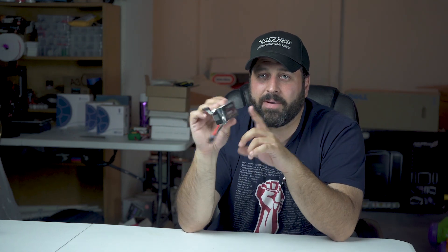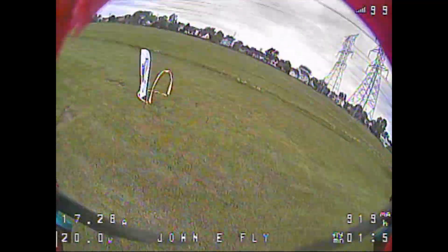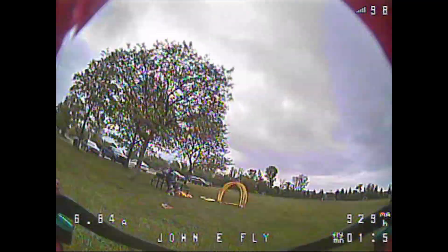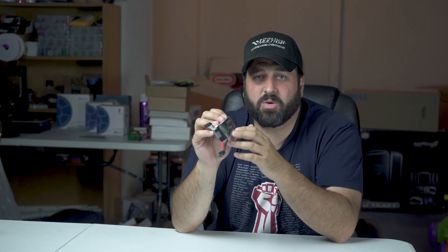The cost of these packs is $29 — the exact same as the Pyrodrone packs. They look real nice, they're pretty packs, and they perform well when you're pulling amps, but the capacity does not match the rated capacity. Today at the field during more testing, I pulled one to 931 milliamp hours, checked the capacity about three hours later, and it was at 3.45 volts per cell rebounded. So 931mAh out with cells at 3.45V — that's just nowhere near the listed capacity. It's a huge bummer for that sort of weight.